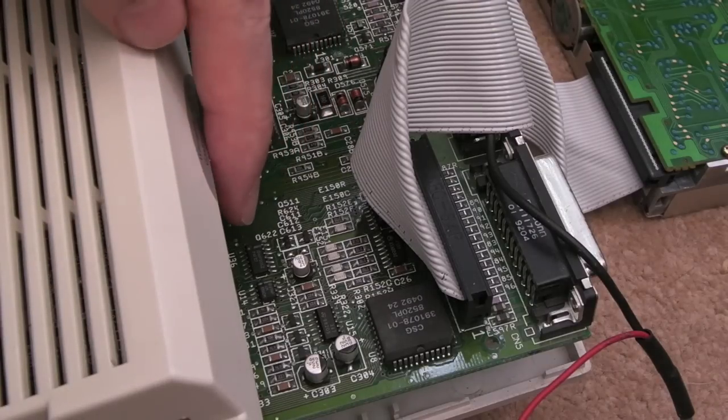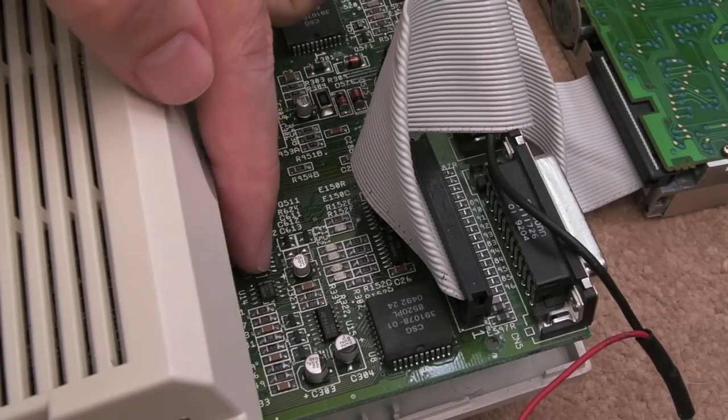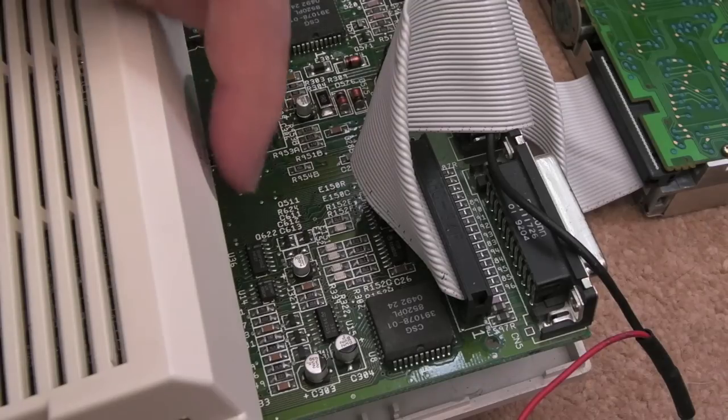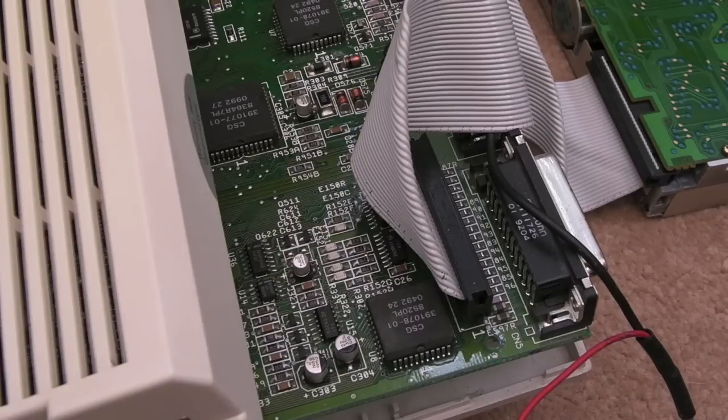Now this little chip here is, I think, a NAND or something, although it shows the inputs inverted and the output normal, which is a bit weird, but I think it's a NAND. And it's three inputs, one output. So you've got the three keys that connect directly to the places on the membrane to detect which keys have been pressed, and then it goes through a transistor or two, and I'll show you on the schematics. Then you get your KB reset signal.